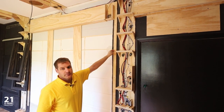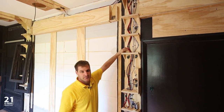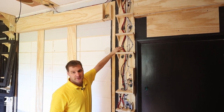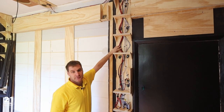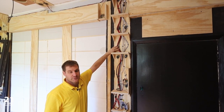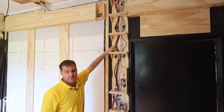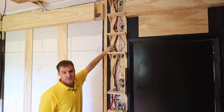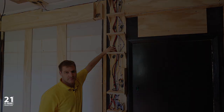What we have done in the cinema room is fastened all of our cables to the timber structure as much as possible. Wherever relevant, we have separated the cables out so that there's no interference between them. And this is to make sure that we can obviously identify the cables very easily, but we're also able to ensure that there's no rattling, because once there's a bit of bass taking place, the cables may rattle against the structure. By fastening them down with cable pins, we eliminate that risk.